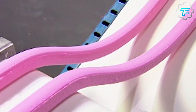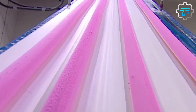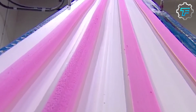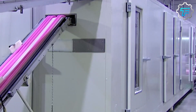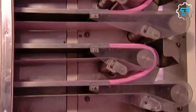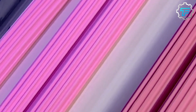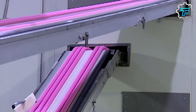After kneading, the gum masses are passed through huge rollers. Huge chunks of the gum are cut and put into a roller that squeezes out the gum into long strips, which are passed through an extrusion machine that cuts these strips into the width of an actual bubble gum. Next, the thin gum strips are passed through a machine that sprinkles granulated sugar on them for seasoning and in preparation for the next phase — cutting.